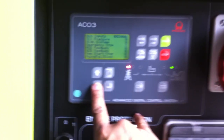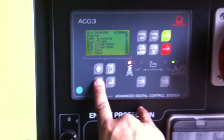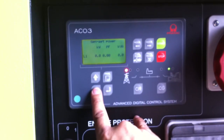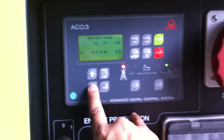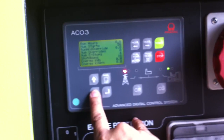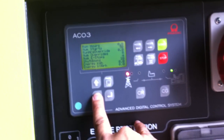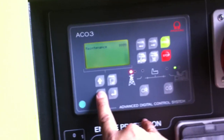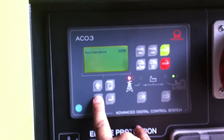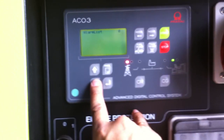To configure inputs and outputs, you need to be logged on as engineer on the controller. There are more inputs and outputs pages, the genset power, kilowatts, power factor, and kVA. Further pages show the hours, number of starts, all the histories, shutdowns, and energy. You can also configure maintenance — you can put hours on there for when it's due for service. This will also give you the alarm list if there are any active alarms.